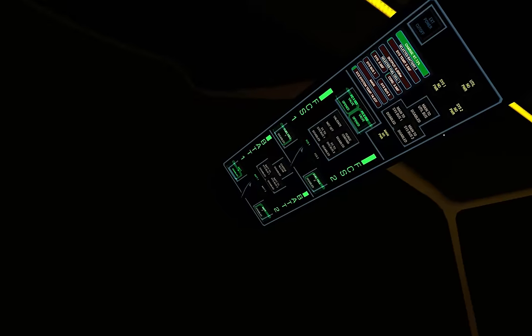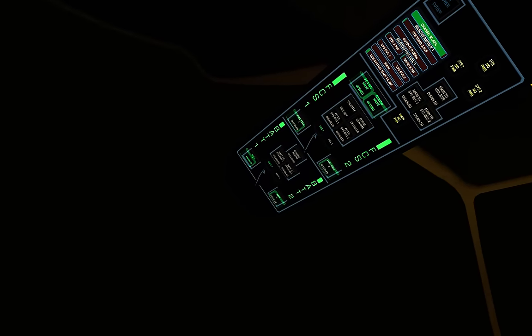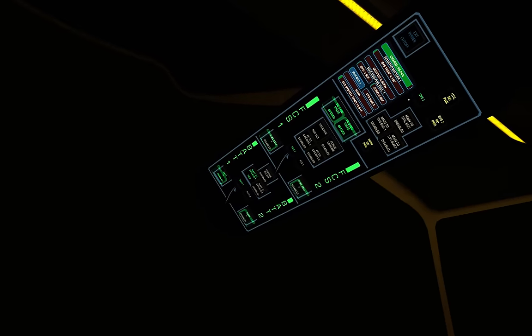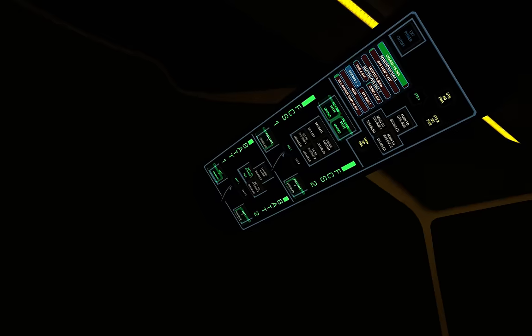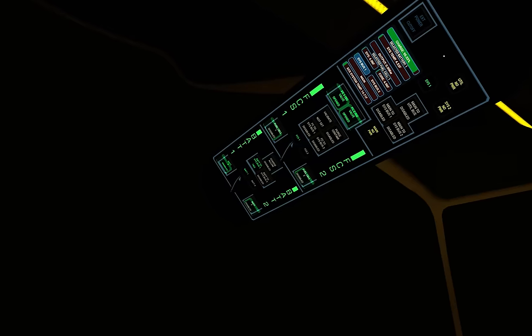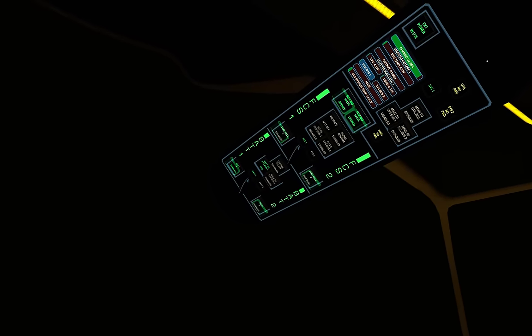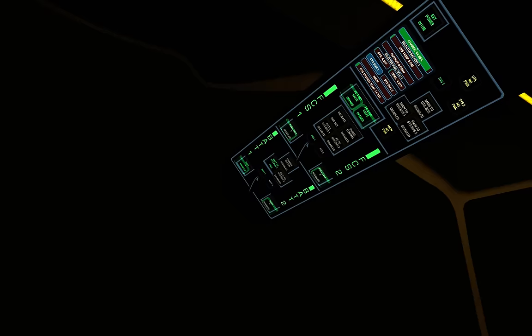If we look at the ECS display we'll see that battery number one is losing charge. If we tie battery number one to bus number one, we'll see that system one bus is now showing green and it's showing a blue bar — that means it's powered. Next we'll enable external power so we're now drawing power from the station, and you'll see that the charge indicator stops dropping on battery number one.